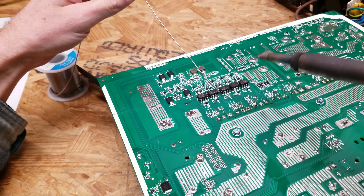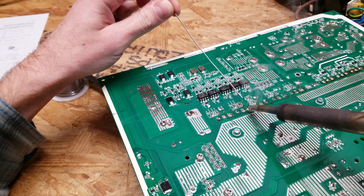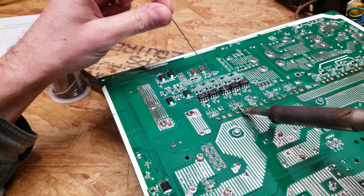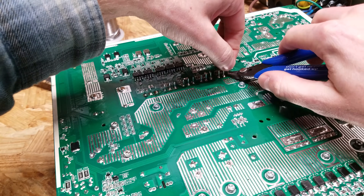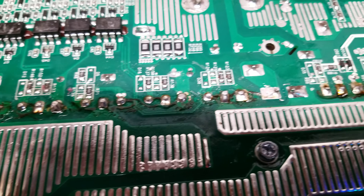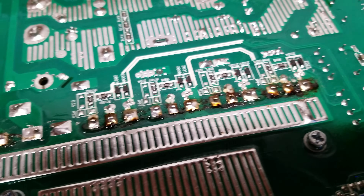This is actually one of the easier parts. Just holding my iron at the pin and putting enough solder on that the pad fills up. You don't want to hold it too long because the solder is going to flow through to the other side of the board — you want some to flow through, but you don't want to saturate the other side so it starts dripping. Once they're all soldered down, go through with flush cuts and snip off the extra lead pieces. I'm sure some of you could do a much better job, but they're soldered down and I don't see anything wrong with these joints. I might use some isopropyl alcohol to clean up the flux residue that's left over.